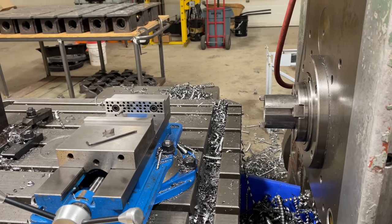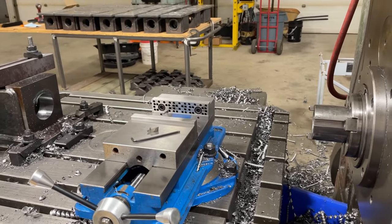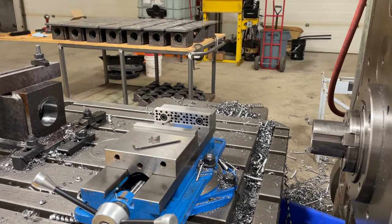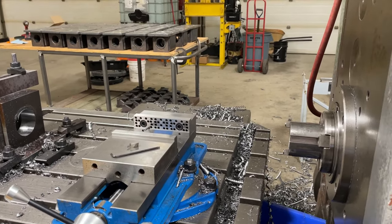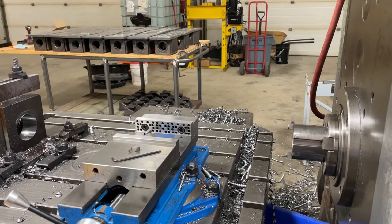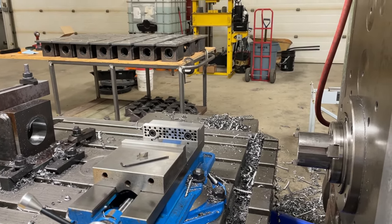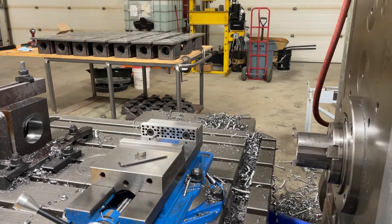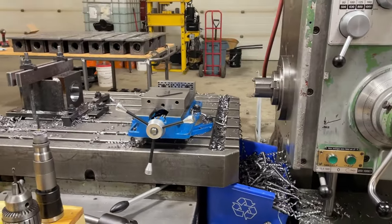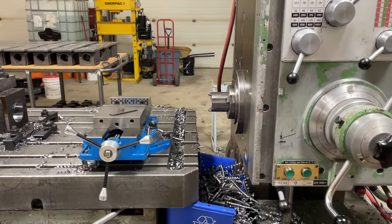And that's important because you can do jobs with these machines where you may get your spindle through a small hole on the outside of a gear case, and then inside the gear case in line with that hole is a bigger hole that you have to bore out. And the spindle may be the only thing that fits through the outer hole, so you put it through, and then once you get it inside the gear case, then you clamp a boring head in, bore the bigger interior hole, then you have to remove the boring head, then you have to retract the spindle through the small hole. So you get situations like that on boring mills, and you want to be able to remove the tools anywhere along the travel. And by having a telescoping drawbar, you can do that.